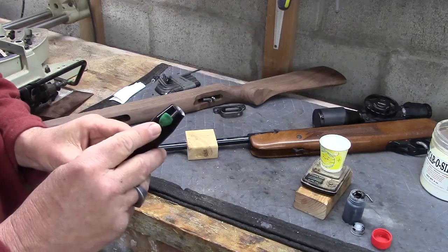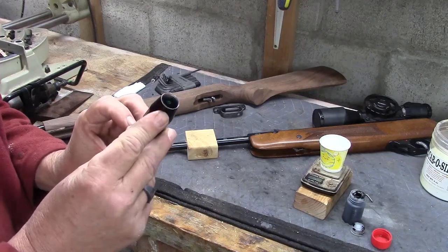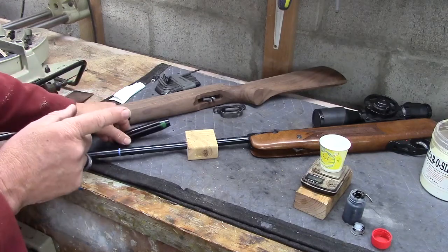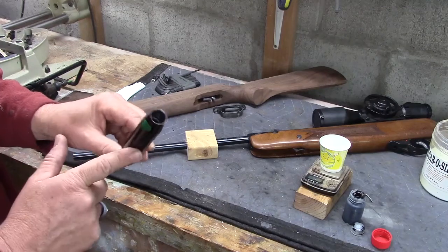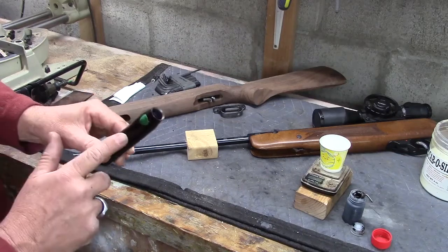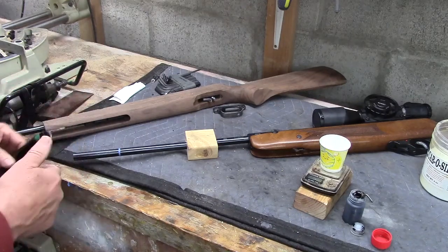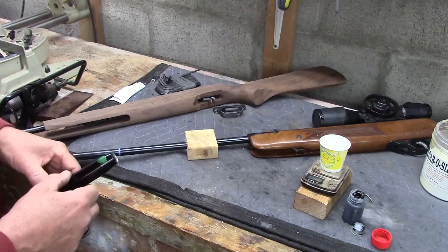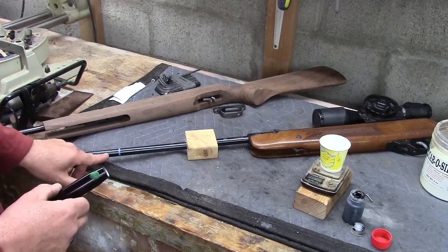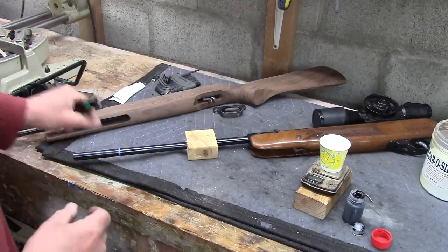I used plasticine modeling clay over the grub screw hole, making sure it comes out on the inside and is nice and flush. So then we're going to mix epoxy. After scratching it, I did an acetone wash inside to make sure there are no residual oils. So hopefully we get a good bond of the epoxy to the muzzle brake and no bond to the barrel. After this comes off, we clean it up - it should be a microscopically absolutely perfect fit onto the barrel. We're also going to machine a little divot in the barrel for the grub screw to go into, because this is a manly caulking gun and you sure don't want this to slip off the barrel.